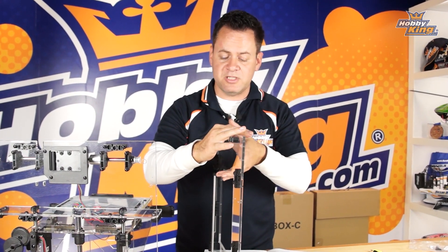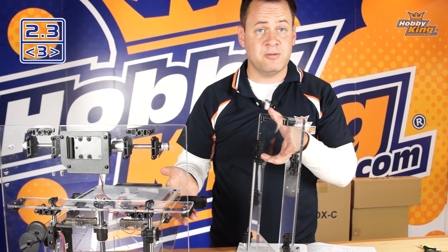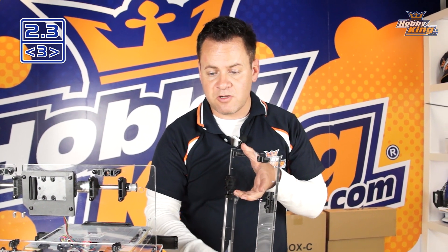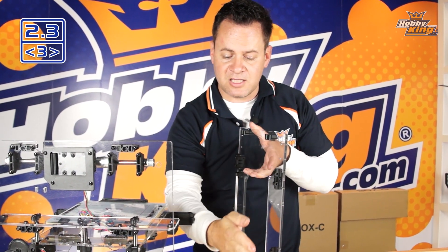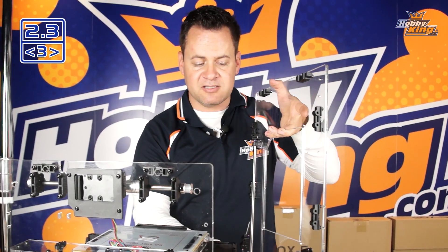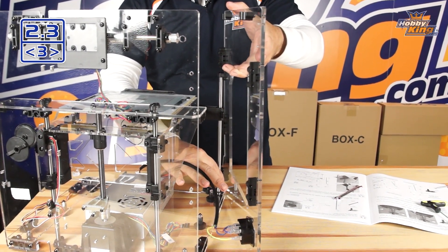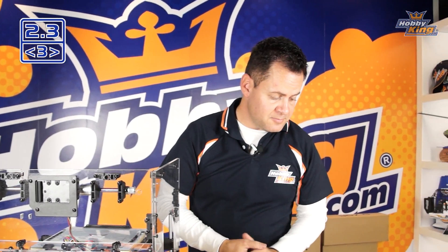On this assembly, we need to line up the linear rod with the bearing support for the print platform. As it comes down it's going to line up and go into the bottom support for the rod. Because we've installed this there's a clearance issue, so we're going to hold it at a slight angle, slide it down, line up the hole and then sweep it on in. Just line it up with the bearing, slide it down, look at the bottom, line it up and sweep it in — real simple.